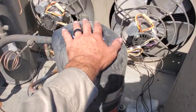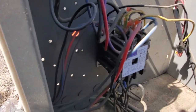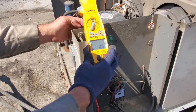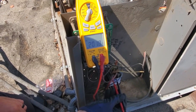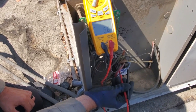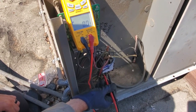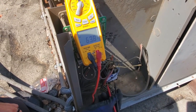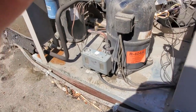We're going to get our meter out and check voltages. The compressor is hot to touch. The compressor contactor is pulled in, so we're going to check voltages now. Checking the top of the contactor — line voltage: line one to two is 201, line two to three is 204, and line one to three is 203. So we have 208 volts three-phase coming into the contactor. Testing out of the contactor: one to two is 201, two to three is 204, one to three is 203. So we have 208 three-phase coming out of the contactor, potentially going to the compressor.